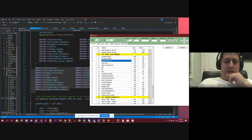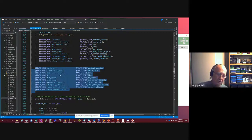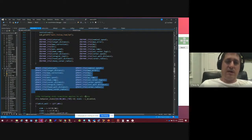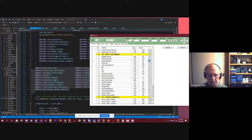I forgot what I'm doing in the background in the direction from PC to robot. Well, I think that's mostly events, if I remember correctly. So every time I hit the plus or minus button here, on my protocol, there is kind of a message that gets generated. Value gets updated on the robot, some flag gets set, and then a little bit of work takes place. But granted, yes, just running these macros here, they do have to look at a flag somewhere. Yes, that does take a little bit of time, but really, the overhead on the robot was insignificant, and on the Bluetooth link, I didn't send this data all the time. Yeah, it's a great idea.